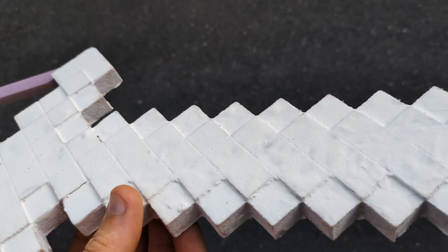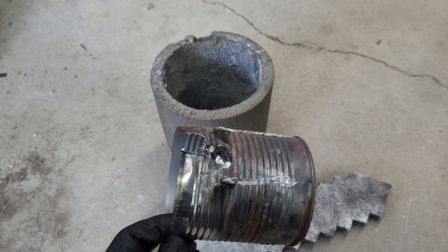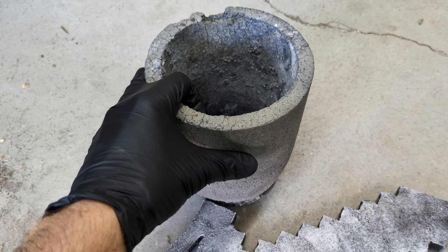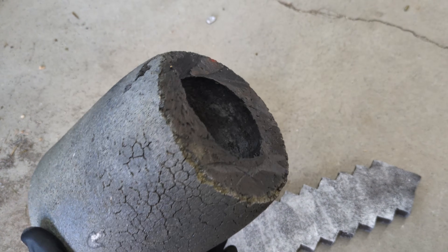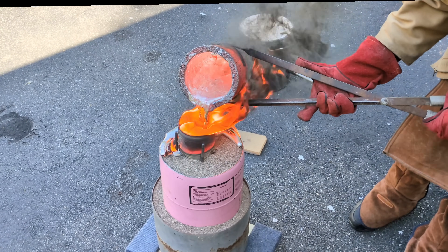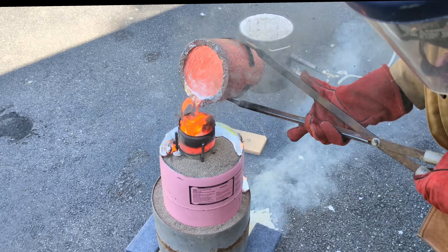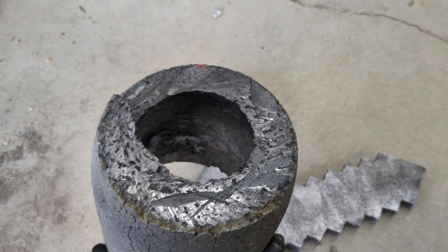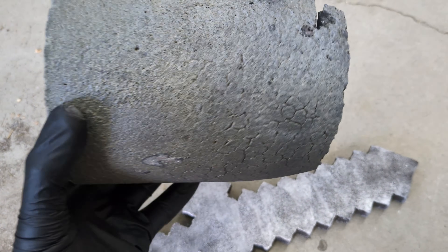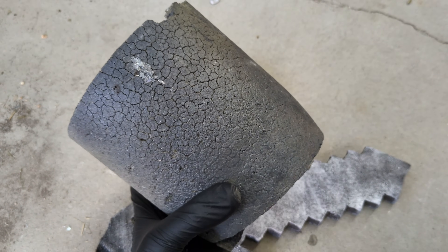Let's head into the garage and start working on this. Previously I did a test cast using a standard foam pattern that I made using this little soup can. This time I used an old crucible and cut the bottom out of it, because last time I had a spill — I couldn't see because of all the black smoke and the can was just really too small. If you're interested in watching the full video of that pour, the link will be in the description as well. Because this crucible is the same exact size as the crucible I'm using today to melt down the aluminum, I will just pour the entire amount of aluminum from the crucible I'm melting into this one. I think it's a pretty good idea.